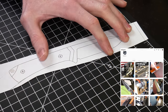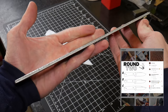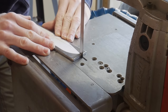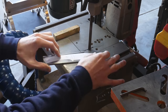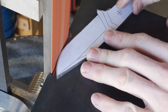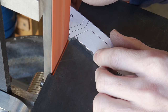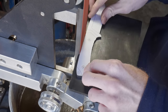Welcome back to the shop. Recently on Instagram I polled you to find out which of three designs you liked best — the clear winner was design C. I'm going to be calling this my war knife since it has a very tactical look with the clip and the hollow grind. We'll be using 180 thousandths of an inch stock opposed to the 125 thousandths we normally use, because this knife needs to be beefy. I'll be putting a clip into the top of the blade with a false edge and hollow grinding the bevels — two things I haven't done in a long time, and with the hollow grind I don't think I've ever done it with success.